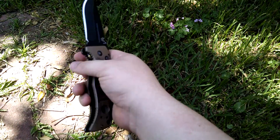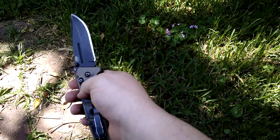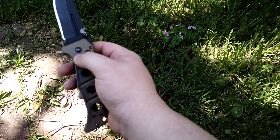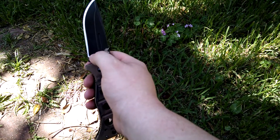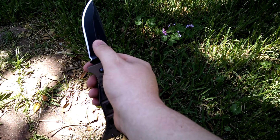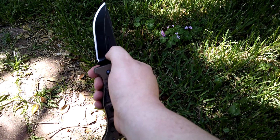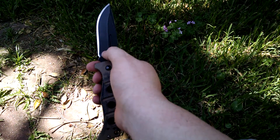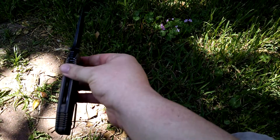...this is made to open ammo crates and dig in the ground and all kinds of weird stuff. I just vehemently disagree that taking a blade of this thickness on a folder — which is inherently going to be fairly weak anyway — doing this hollow grind and expecting that to have some drastic toughness improvement, especially with this D2 being 61 to 62 Rockwell. Instead of doing a nice full flat or, like they did on that Ruckus I showed in one of my last videos — that has the same blade thickness, similar blade width, vastly better edge geometry.